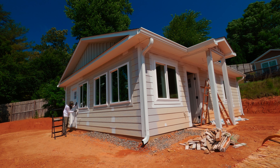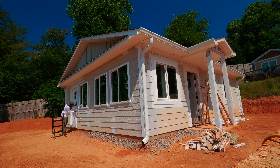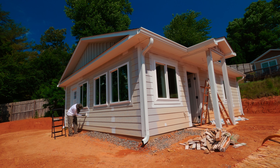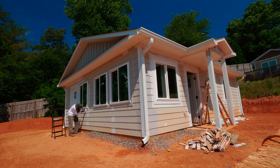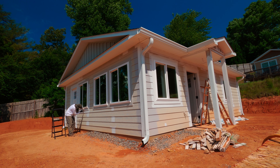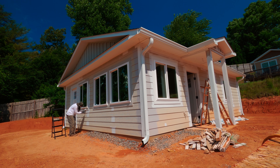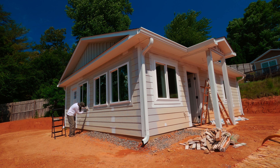That's basically me using a roller and putting the primer all around the windows. You can see the spots where the butt joints are on the boards, where they butt up to each other — I had to put two or three coats on those, and two or three coats around the trim on the windows. Anywhere that caulking touched, I had to fix it.